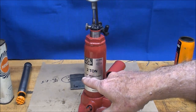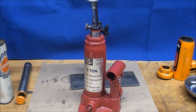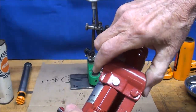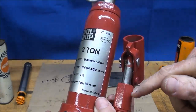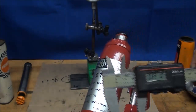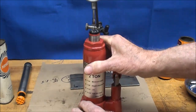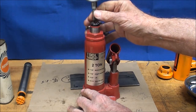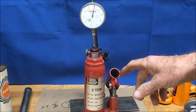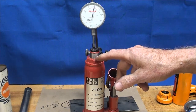I'll finish with this other jack, which is also a two-ton. What I've done is opened up the pump and measured the distance from the hex up to the paint mark — that's the length of the stroke — which is about 820 thousandths of an inch. Now by putting the jack under a dial indicator, I'm going to pump it one full stroke of 820 thousandths and see how much the ram raises.